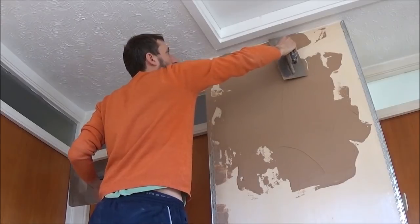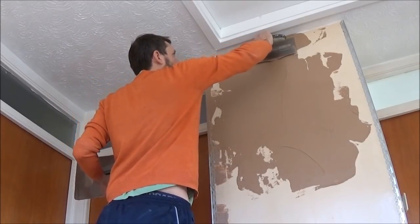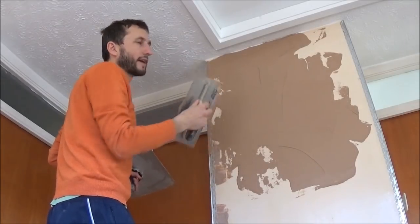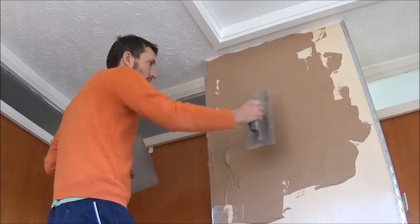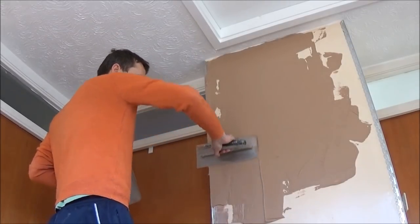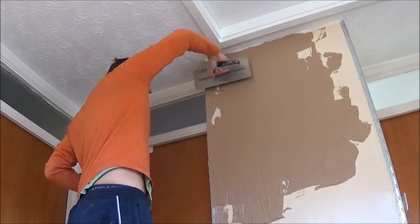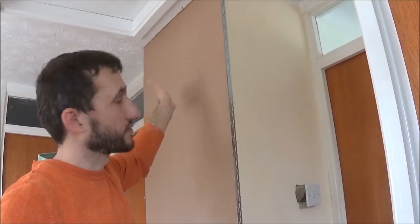Go across and down. What you want to avoid is putting too much near the top at once because you start to get a thick line near the ceiling and it'll spread over it. Start lower and then work your way up. Here's another little tip — when you've got bead on the end it tends to bring the wall out a touch. Fill the line going horizontally but then go back over it in a vertical motion, because going horizontally pulls the plaster in and out and puts a little curve on the wall. Go over it with another load of plaster, straight up the wall, and it'll fill out and give you a nice straight line.